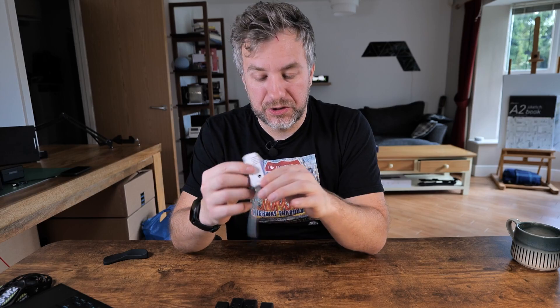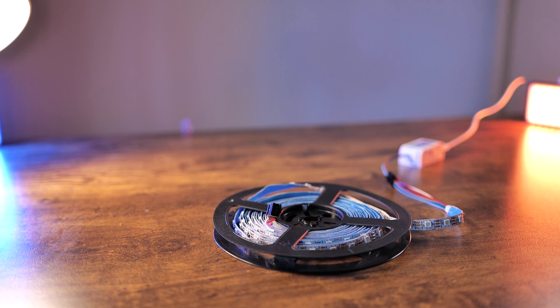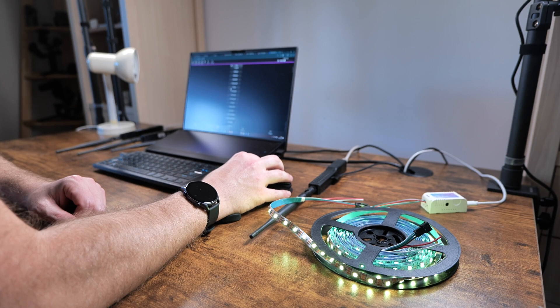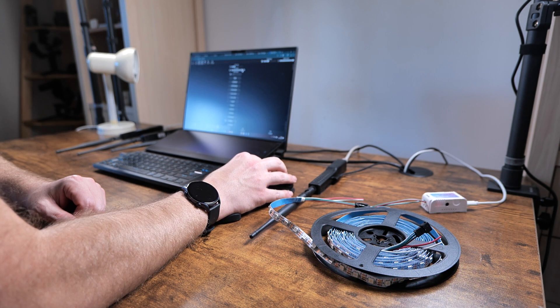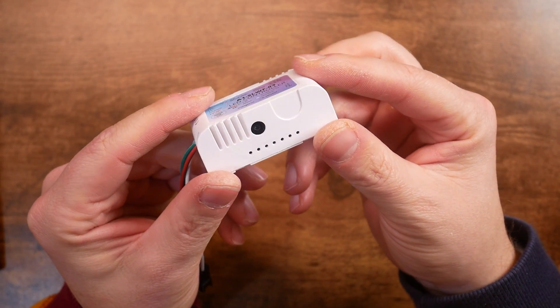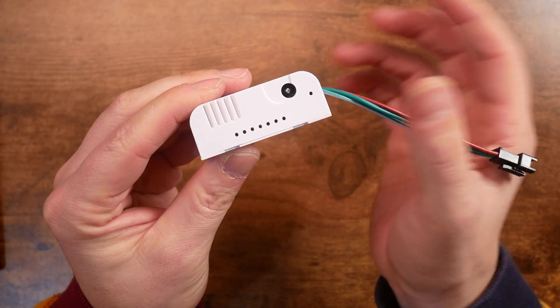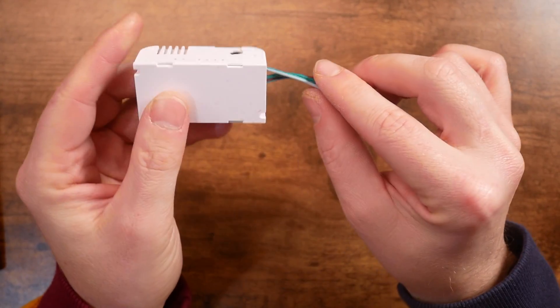The last product I received is the A1SL WF03, an LED controller for LED strips. It's a WLED-based controller with an ESP running WLED firmware. It has USB-C for power and data, a barrel jack to route power directly to your LED strip, and supports up to four different outputs — voltage, data, ground, and an additional configurable pin. It also supports infrared remotes if you want to go old-fashioned.